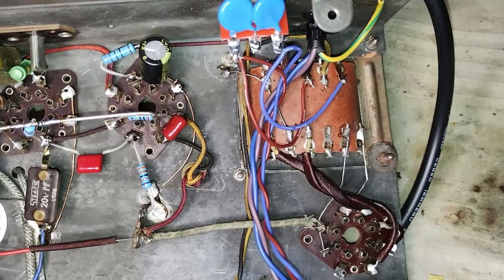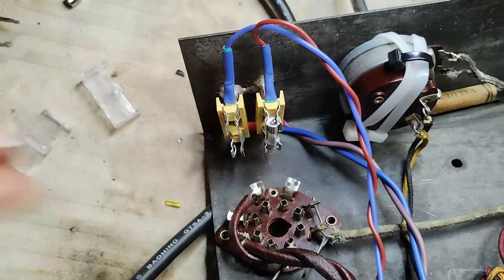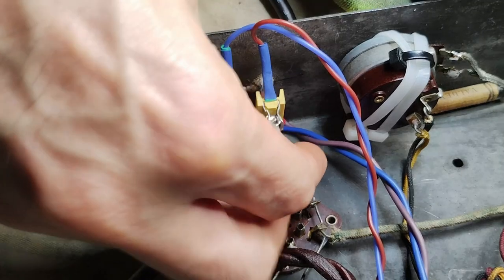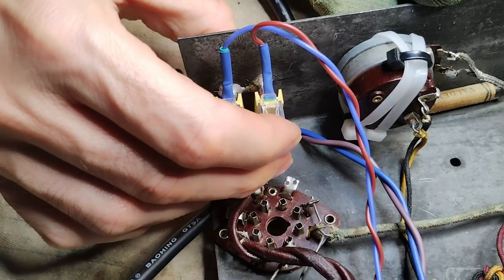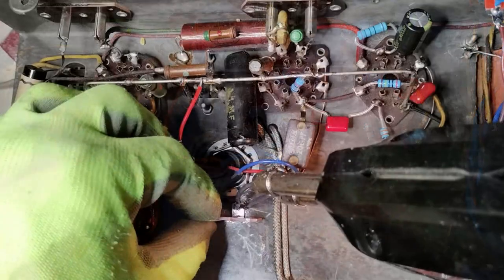This radio absorbs about 50 watts, which means that with a voltage of 230 volts, that would correspond to a little more than 200 milliamps. Nevertheless, fuses type F0.1 amps are installed because they have been tested and will not blow until about 800 milliamps. Another tag strip is going to be installed. It will serve to anchor the replacement electrolytic filter capacitors.